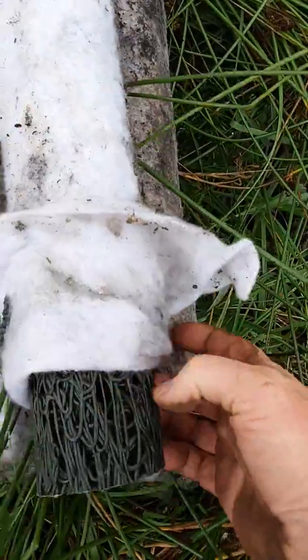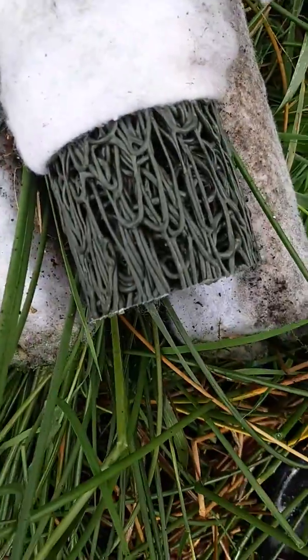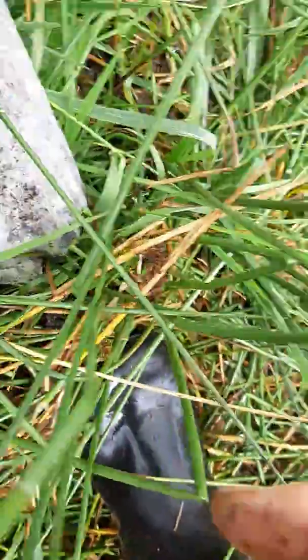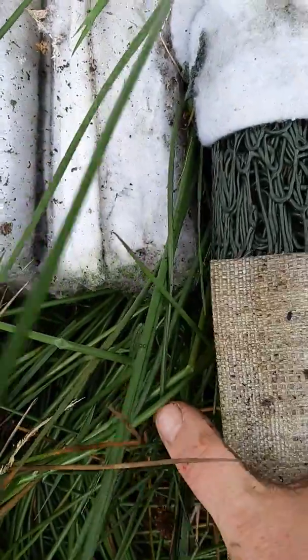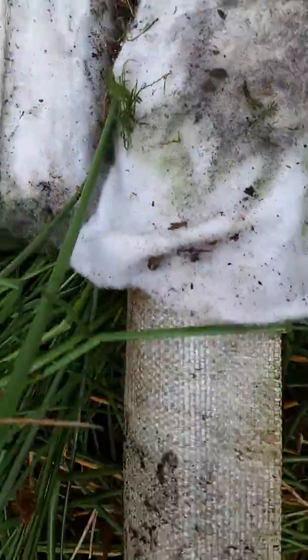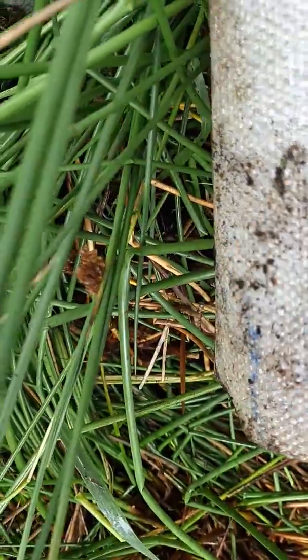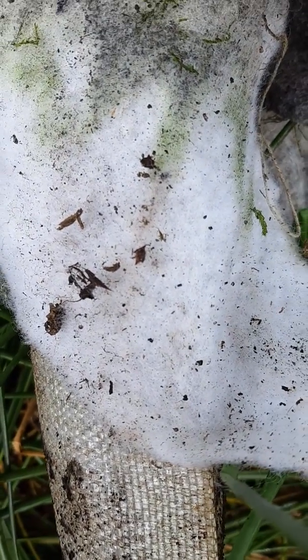What we do is fold back this sheet and get the collar — this thing here — and open it up. So you just put that on the end of the pipe. We push it up on the pipe, pull down this geotextile, put the next pipe in here, and pull the geotextile cover of that on top of this, so the whole thing is a continuous geotextile covering.